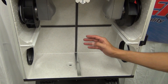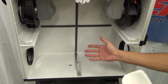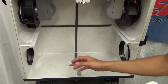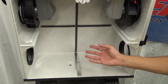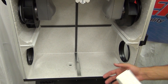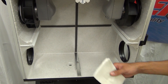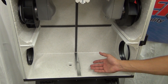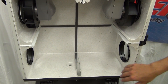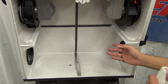With our core and pre-filters out, we can clearly see inside of our unit. Now is a great time to check our sloped drain pan for any buildup of dirt or debris. If we find any, we can clean it out with a mixture of water and vinegar and a non-abrasive cloth. While we're cleaning, we will also want to inspect our intake and exhaust ports. If we find any debris in there, we will also want to remove it.